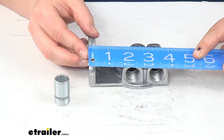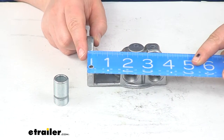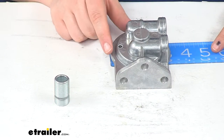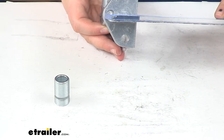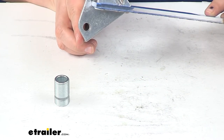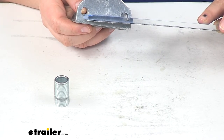Overall, it measures about four inches wide, going from the bracket to the center of where our filter would be is about two and a half inches. At the widest point going this direction, it's just over three inches, maybe three inches and an eighth. The bracket is about one and three-quarter inches tall. The distance between our mounting holes, center to center, is just about one and a quarter on both sides, and at the bottom it will be about two inches apart.